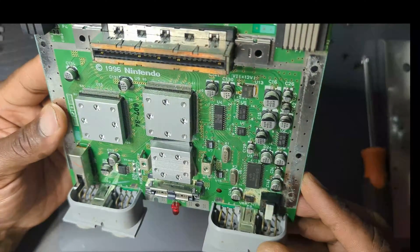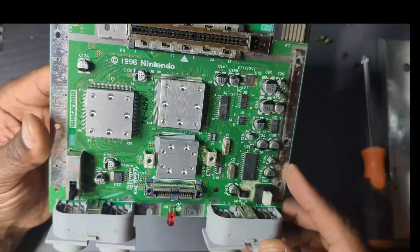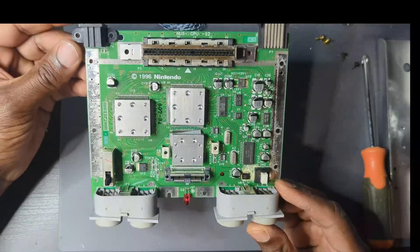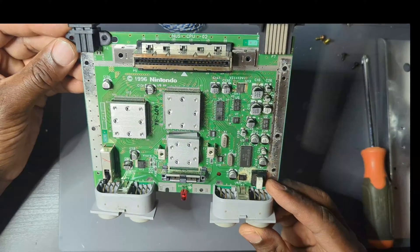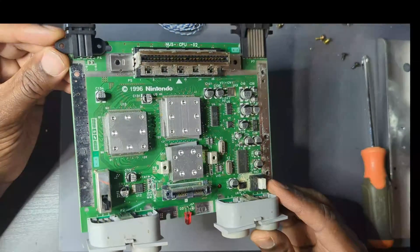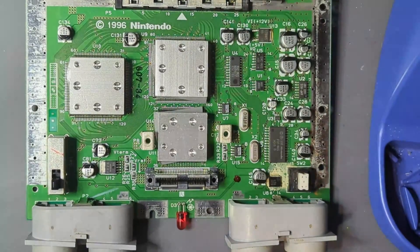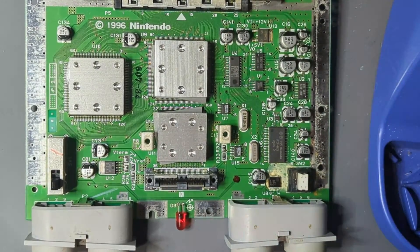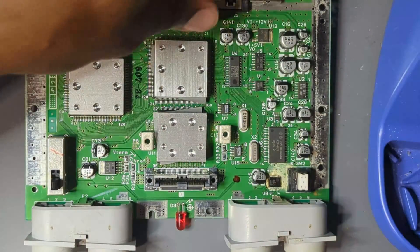I've got to figure out how to get them off the board. I'm going to first try just the soldering iron — if it comes off like that, I'll just continue doing that, and if not I'll use a heat gun. I've got my soldering iron heated up. You want something that has temperature control — you don't want just a full blast of heat. You do want something adjustable when dealing with electronics.